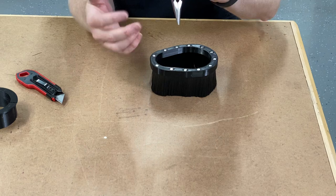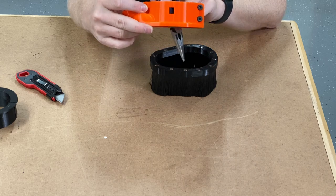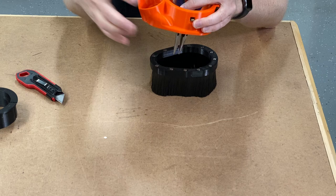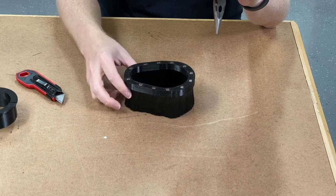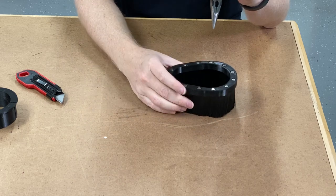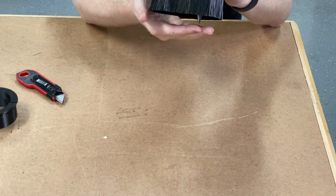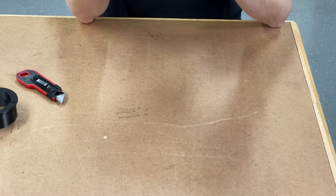You've got your router, you've got your boot mounted on there — just put it right onto the chuck, right onto the body of your router, and tighten these down. Don't over-tighten them too much — just tighten enough that it grabs hold and won't let the boot twist on you. Once you've got that on there, then you've got your brush piece. Be very careful of your fingers — there are 24 strong magnets on this thing, so once you get it close it's going to snap right on there. I have pinched my fingers more times than I can count.